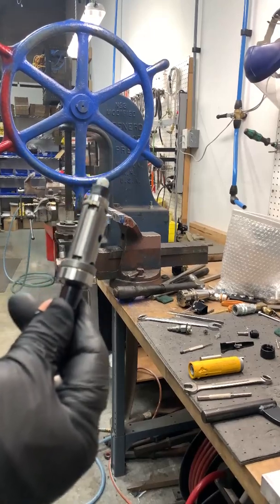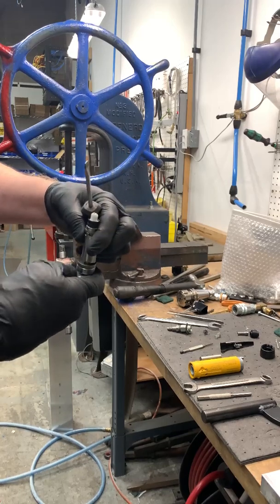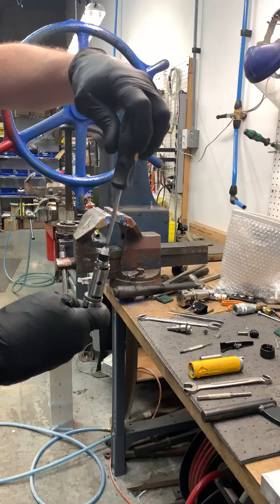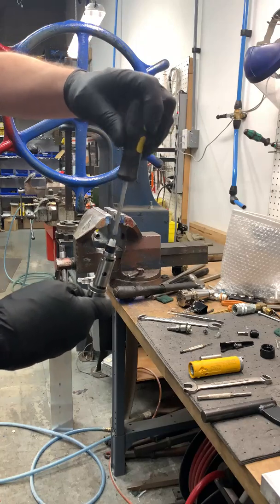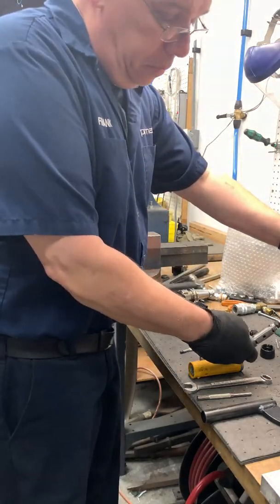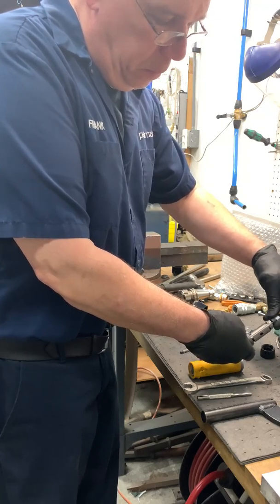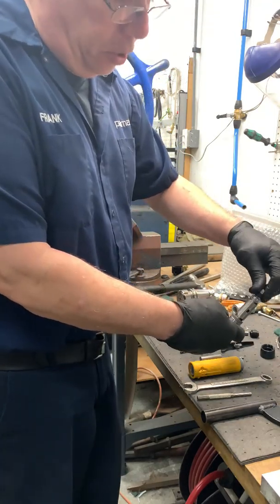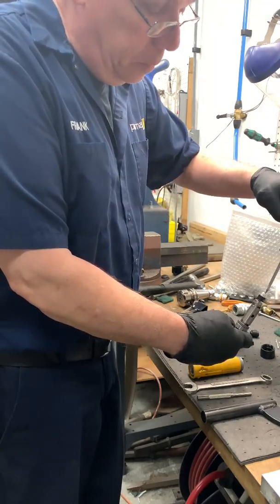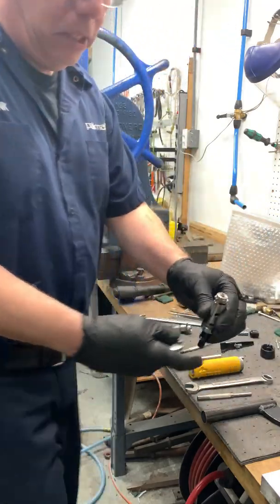Next, we'll be removing the governor. And what I do is I take a 12mm wrench and hold the collet and take the screwdriver on the back of it, and it's a standard thread, and remove the collet on the back. Be sure not to separate the collet. Separate the governor, I'm sorry. The governor comes right off the back. And that's how it looks without the governor.